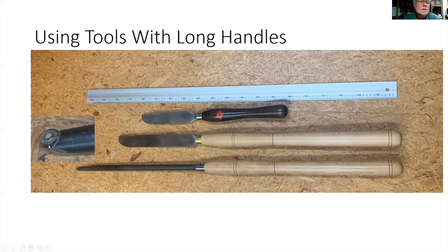This is just a round cutter here. But the cutter bottom is set at an angle into the shank. So it's the bottom tool in this array, is that right? Yeah, that's the bottom tool. That's the one I used for most of the hollowing, and that's the tip of this bottom tool. Yeah, it's a cup cutter.